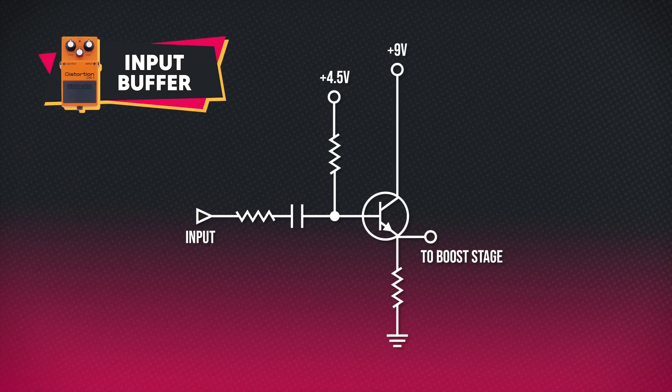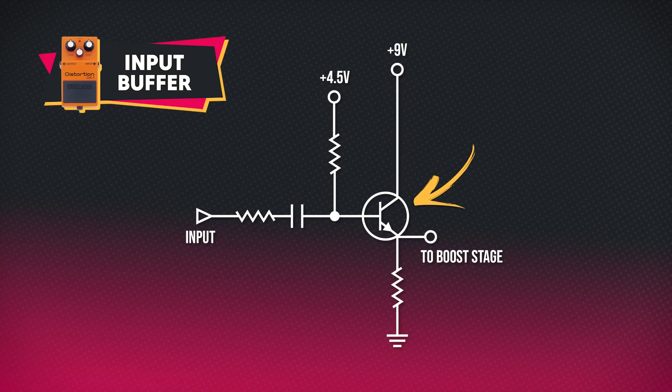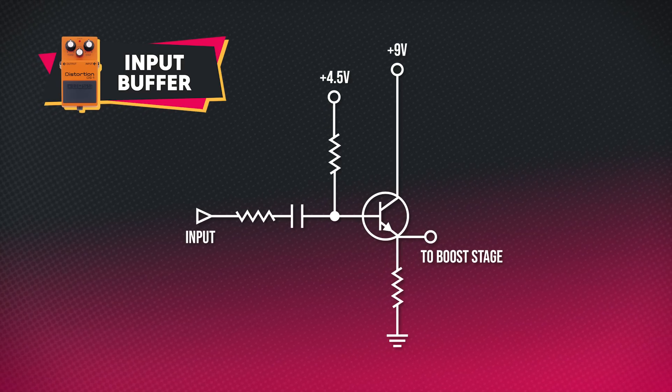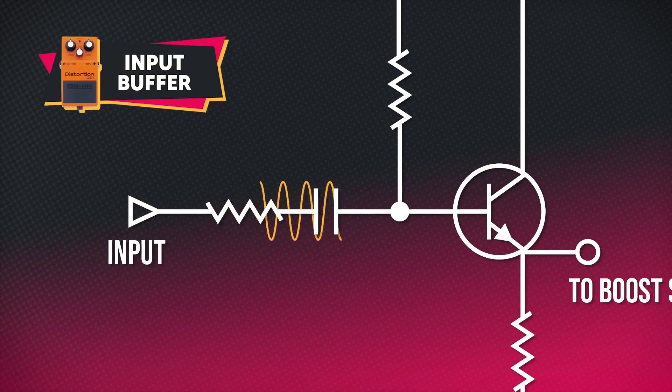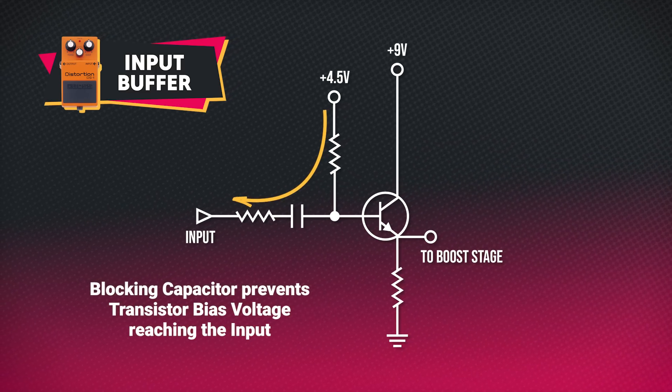Here's a closer look at the input buffer. The job of any buffer is to change the signal impedance while retaining unity gain. Unity gain simply means that the output from this transistor will be at the same level as its input. The buffer does not increase the signal amplitude — it's simply there to act as a junction between the high impedance pickup signal and the low impedance pedal circuit, cushioning the collision so as not to incur tonal losses. If you pay attention going forward, you'll notice capacitors like this one at the start of each section of the circuit. These are DC blocking capacitors. Our audio signal is AC and can pass right through these capacitors without issue, but any DC voltage hitching a ride on the signal will be stopped by the blocking capacitor. This is perfect for removing bias voltages that we may want to add to make our pedal work.